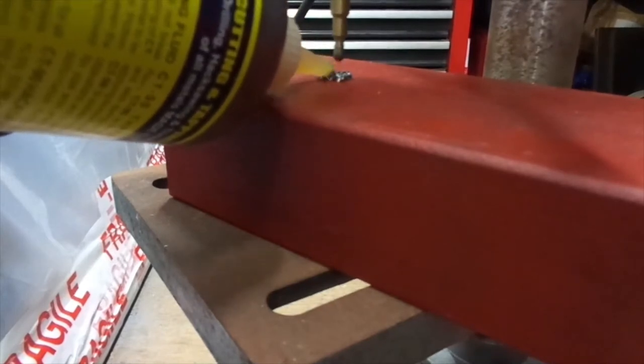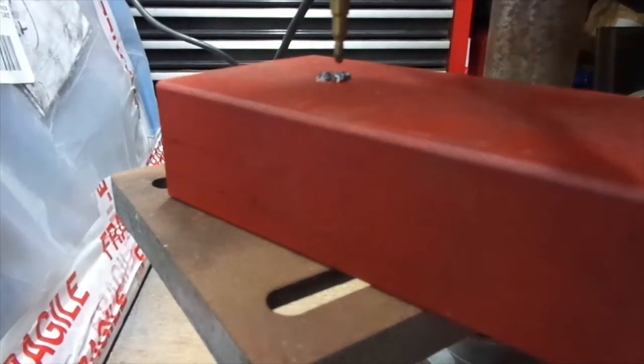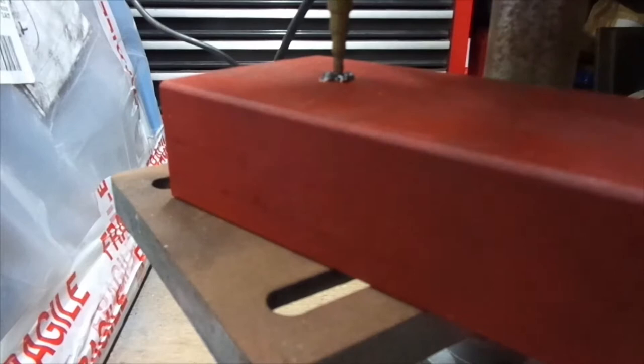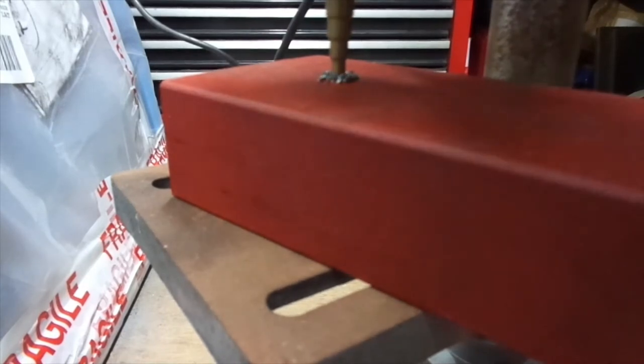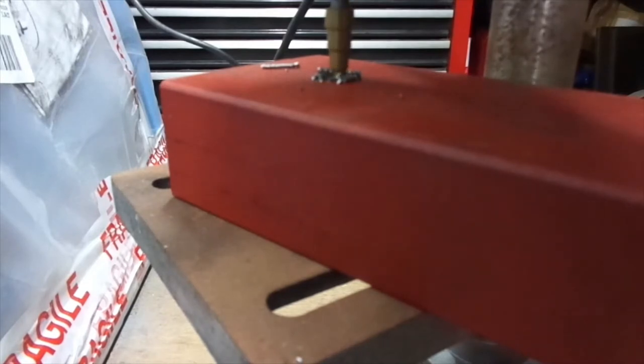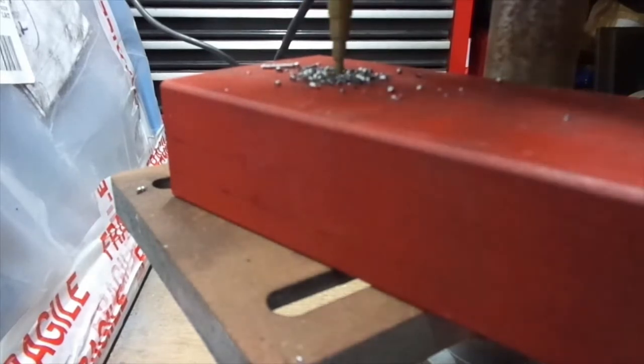Put it on the actual piece. You'll notice I'm not actually clamping the work down either. It's 400mm long — there's a lot of leverage there. It's not a very high torque drill, so I'm not worried about it snatching out of my hands. If it was a much smaller piece, I would clamp it. We just made it through. That's gone through well. And I think the last step here is 10mm. Just add a bit of a chamfer from the next step. That worked pretty well.